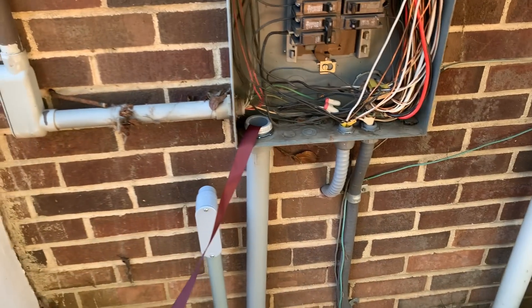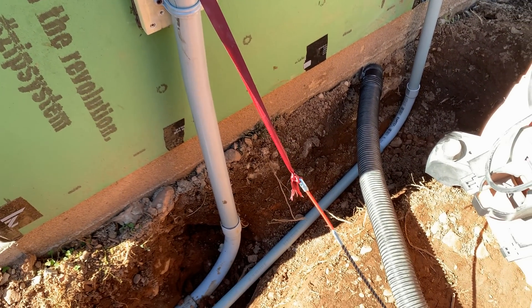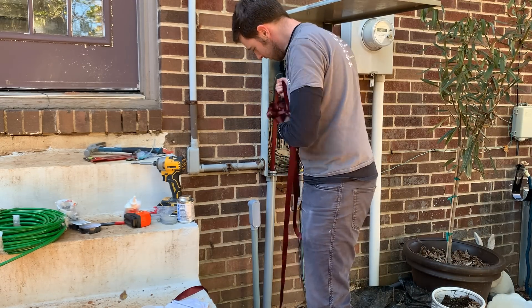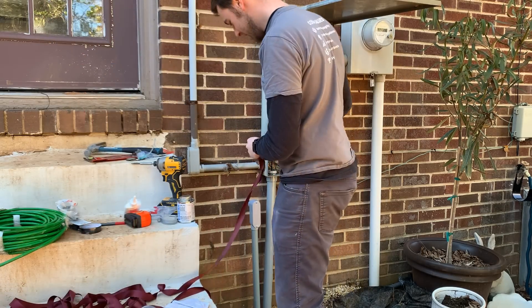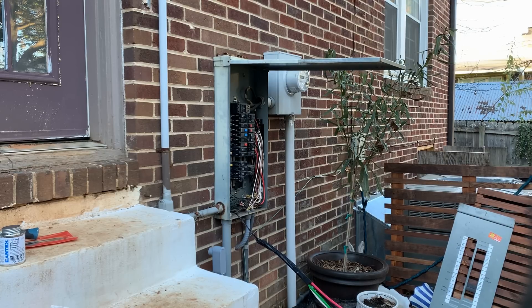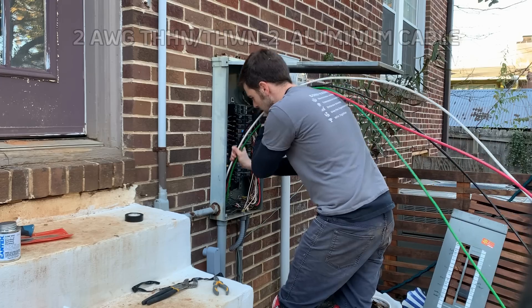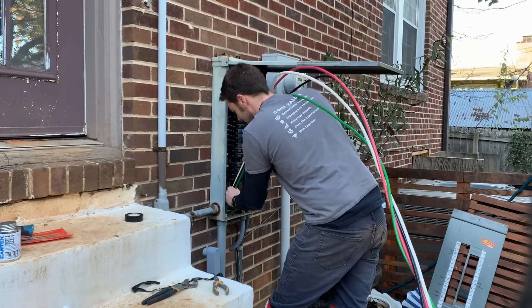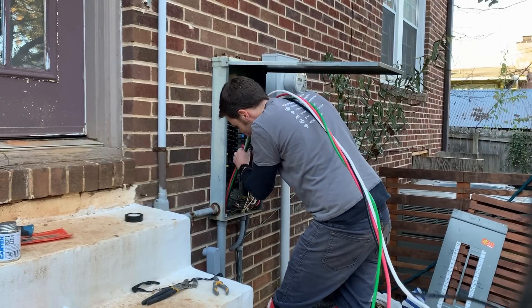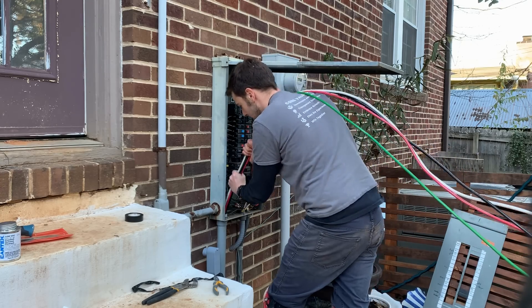With the conduit in place, we're ready to start pulling our cable. My first step was placing a long ribbon at one end of the pipe and pulling it through using a shop vac from the other end. I'm then tying a stronger wire fishing cable to this and using the ribbon to pull that fish all the way back to the house panel where we originally started. With the wire fish ready, I'm using electrical tape to secure the four conductors I'm going to be using to supply power to the shop. For this project I'm using 2 gauge THHN aluminum cable which is rated for wet locations and is a great option for use in underground conduit. These conductors are sized to provide 90 amps safely over our distance of about 60 feet. You'll notice the four wires aren't bundled in a single cladding like we saw with the Romex cable — the conduit is our cladding in this case and we want the conductors loose from one another as it makes it much easier to pull this bundle through the pipe.